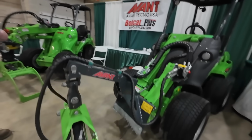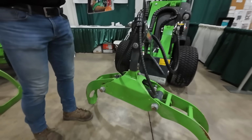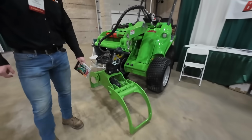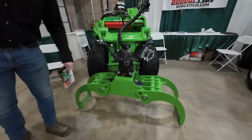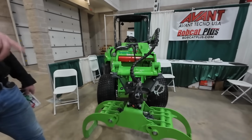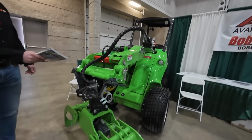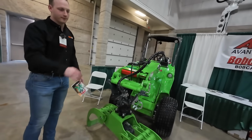As you can see on the front, this is our timber grab. This is actually a true knockaround. So obviously when you grab the material, you knock it around in order to adjust it, get inside the chipper. This one right here is called a multi-task. It's got a 5.5 ton rotator right there, so you can grab material. Articulate the whole... Yep. Spin it 360 continuously. Nice. You can grab trees, whatever you might need to do when you're cutting, feed wood chippers. This one is also available in the heavy duty timber grab. That's going to come out like an L as well. Makes it really nice for loading trucks.